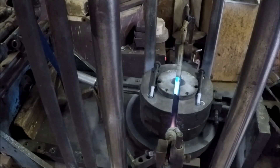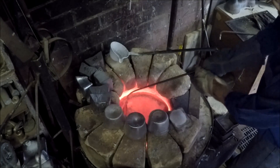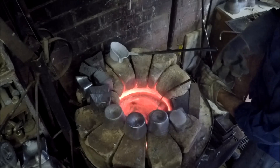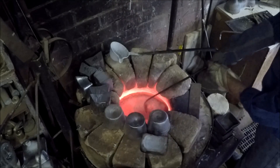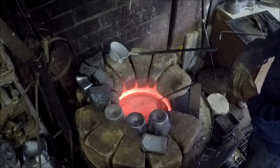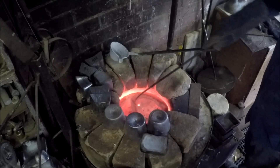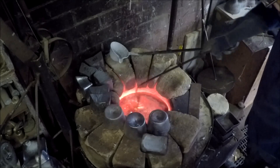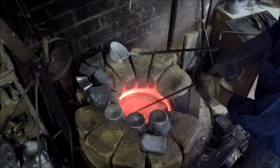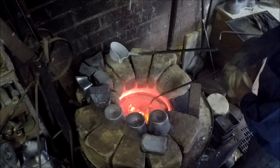We'll spray it up and we're ready to go, just waiting for the metal now. I'll flux the metal — first of all I'll just remove what little dross there is on the top, add some flux. Normally I'd have a fan going but I've left it turned off to cut down the noise so you've got a chance of hearing me. When stirring this in you need to be fairly gentle. You see people on YouTube stirring their metal like it was paint or like they were mixing concrete — very bad for the metal to do that. It just increases the oxide load and the hydrogen load.